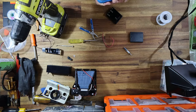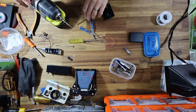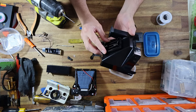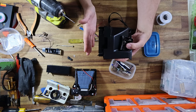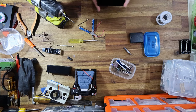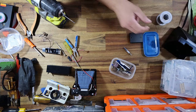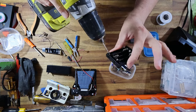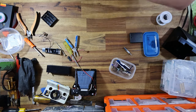One thing I do have to do is drill a hole in the battery box, which will allow me to poke the wires through the inside of the camera. We're going to be mounting this battery box on the sloped rear surface of the camera — about here. That's really the best location as it doesn't add any extra size to the footprint of the camera, keeps it really compact, and we're still going to be able to put the top flash housing on. The ABS plastic of the battery holders I keep in stock is identical to the Polaroid OneStep's original plastic, so the camera ends up looking really original.